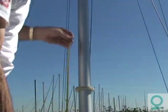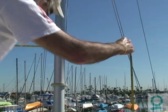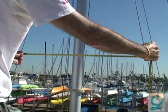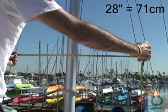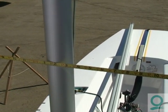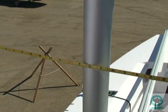The next way we're going to measure our lower shrouds is by measuring the distance across. We measure up 36 inches from the top of the band, make a little mark on the front of the mast, and then measure across. This is a little bit of a judgment call — how tight do you pull the tape. Some guys have a shock cord set up that holds it steady, which is not a bad idea. Right now I have 28 inches between the shrouds, and that's a pretty good starting setting. With 28 inches side to side, the center line of the mast should be about 14 inches, which is exactly where it is right now.